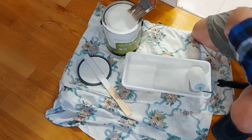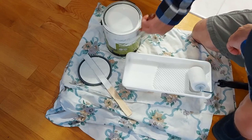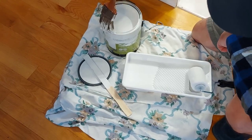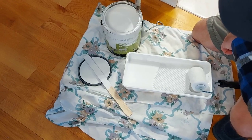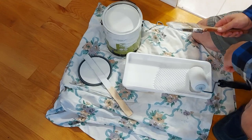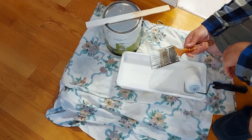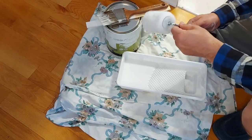I'm going to go with my brush like this — it just makes everything quicker and easier, and you don't have big clumpy messes of dry paint on your can. Just run that brush around in here and pick up all the wet paint. It just makes your life easier later on when you go to open cans and reuse the paint. You can put your lid back on and pound it on so it stays fresh. Now we have our tray full of paint and we're going to wash the roller, cage, and tray a little later after we do our priming.